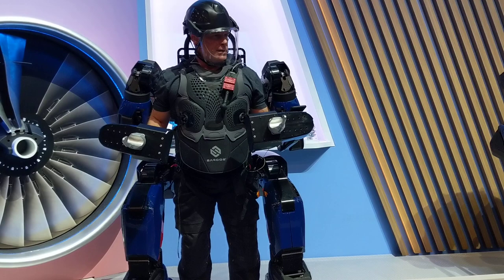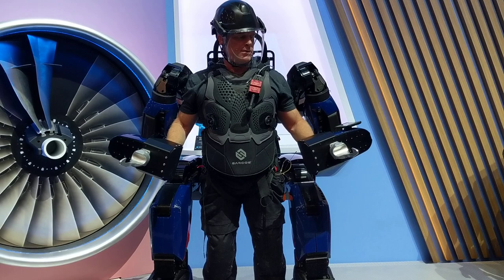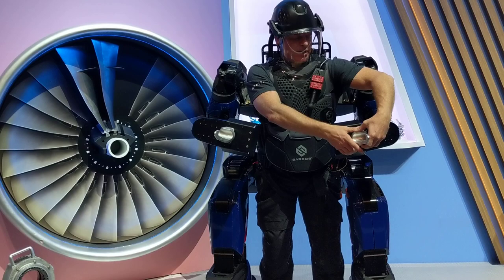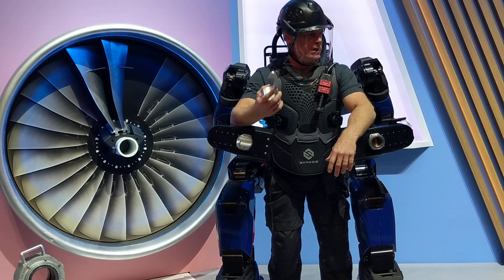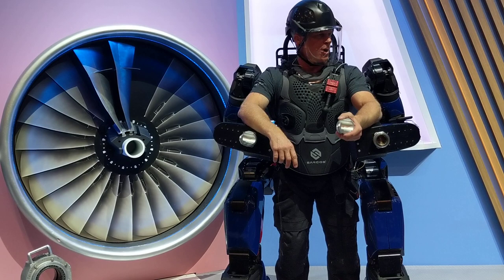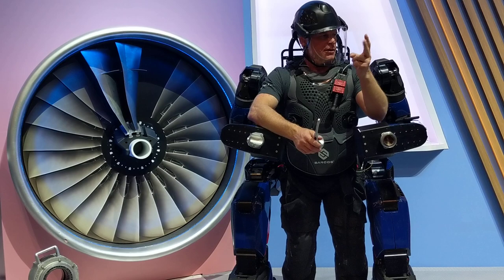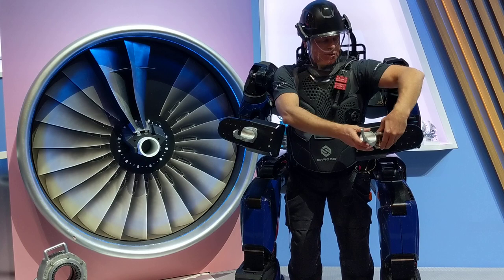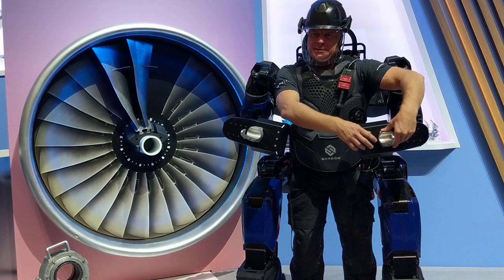Key things to take away there is the robot did all the work for me. I didn't need to be strong. The robot lifted it, put it in place. I can lock out my arms and use my hands for a more dexterous task. What we have up in the front — these are called end effectors. These are basically tools. This is what I would call a multi-use utility tool end effector. It can serve a number of purposes. When I picked it up, I just put a single bar underneath there and hooked it — it's actually got a handle. The end effectors to my rear that look like fingers might have been a better tool because it probably would have provided a more stable base. So it's all about the end effector, it's all about the tool. And that feedback on what tools are necessary for the desired task at hand — to make it most safe, most efficient — will come from the workforce.